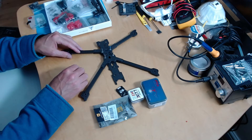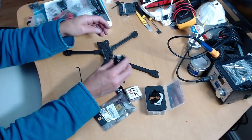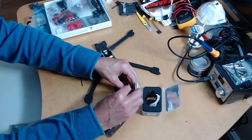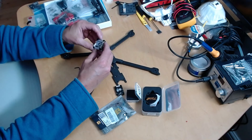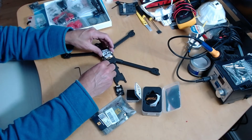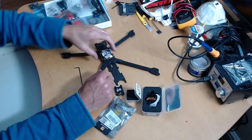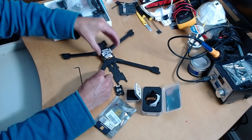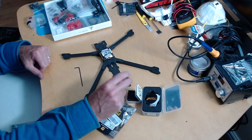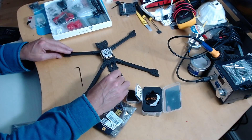The next thing I'm going to do is dry mount the ESCs and the flight controller to see how it all fits. You can see there's not a great deal of room, and once we see where the top plate sits, it seems unlikely you can get a stack of three on there. So my VTX and receiver are going to have to go elsewhere, which I think is fine — I'll talk about that in the next video.